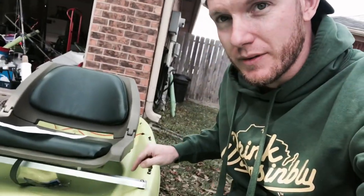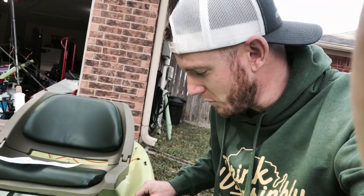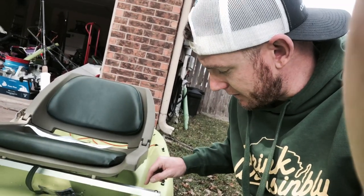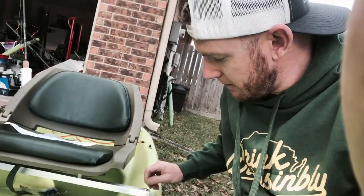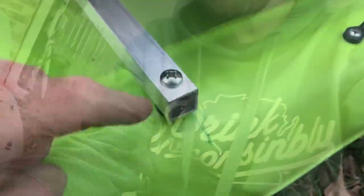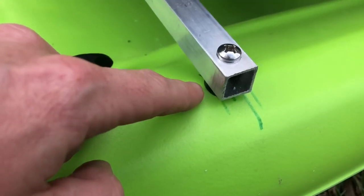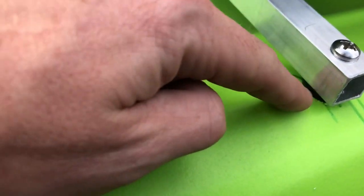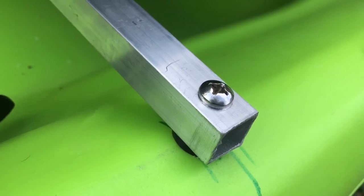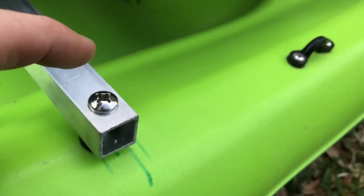The parts I had to figure out for myself from Joe's video: this bar right here — this is three-quarter inch aluminum square tubing. Once you figure it out, it looks pretty good. Joe's version was a little different; on his kayak, this spot was already inset and had a well nut in it. I had to make my own, so I put it right on the top of the crease on the kayak — the well nut pulls tight and seals. I used quarter-20 stainless steel screws, two inches long — enough to go down through the bar and through the well nut and pull it all tight.